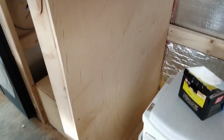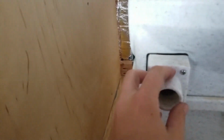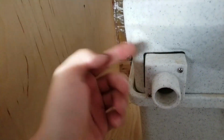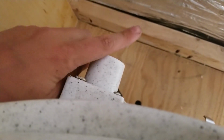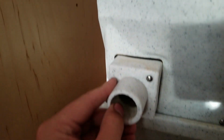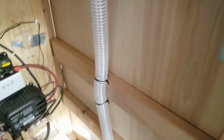Okay, so this wall needs a vent cut, a hole cut in the wall that I can use for this vent, only on the other side it looks the same. You can see, my fan plugs into here, and then the vent attaches to this, and air blows out that way. There's also an air intake here that I just got to leave clear, and it'll come through the wall into this hose that then goes up and out, a roof vent.